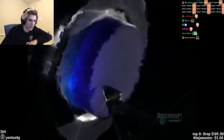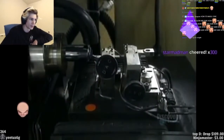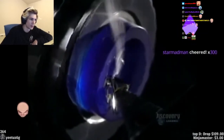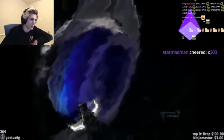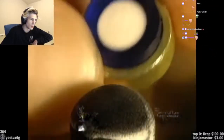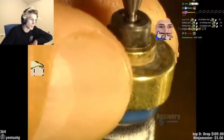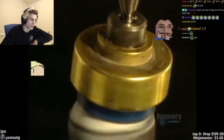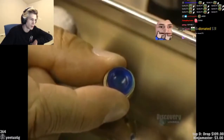They begin by shaping the inner curvature of the lens. This digital lathe, rotating at 6,000 revolutions per minute, is equipped with an industrial diamond. It shapes the inner surface, the part that touches the cornea. It must be free from any abrasion and imperfection, and is polished with a superfine abrasive paste. Polishing is a crucial step because it assures excellent comfort and perfect vision.